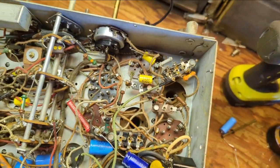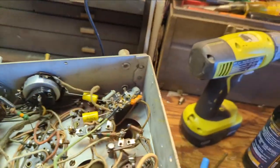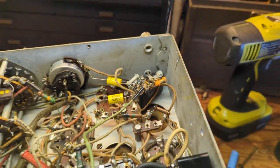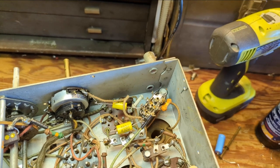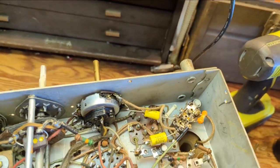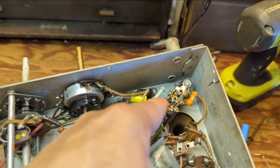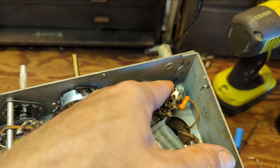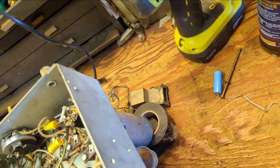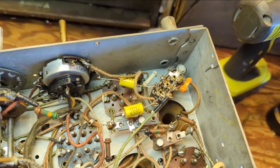Then you just want to brush off the crumbs. Sometimes I jam a paper clip or wire down in there just to make sure everything's clear inside. You want to wiggle it around in there and make sure everything's disconnected — if you don't, sometimes you'll plug it in and get a little crackling spark as the last bits of foil crackle away. I looked this one up — it's an 80-dash-80-35, and it's two 120 picofarad equivalent capacitors. I found some old ceramic caps in my supplies, so one lead of each capacitor goes to a separate connection and they both tie in together, going into one of the RF cans.